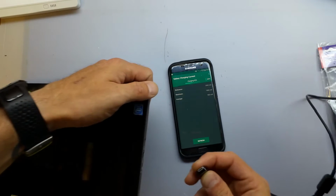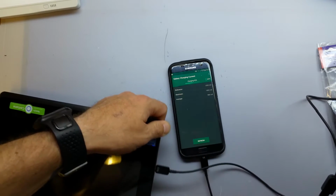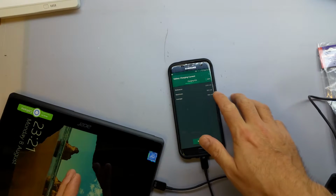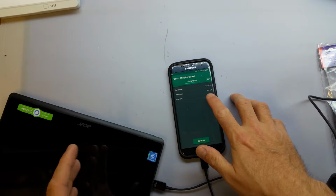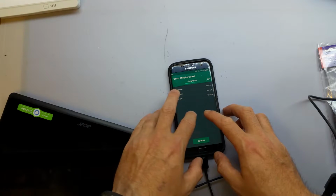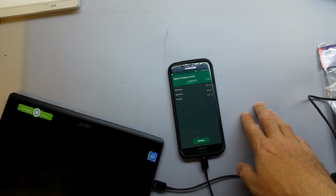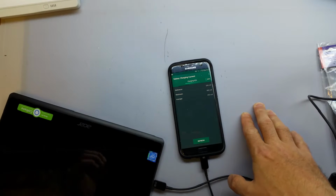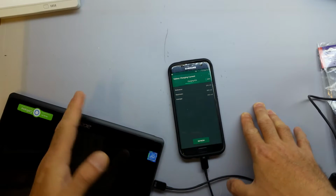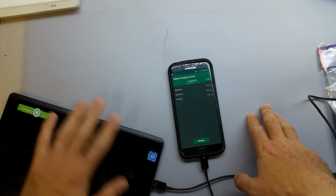When I plug in this tablet, if you remember, it dropped down to about 500 milliamps. But with the genuine charger, it's obviously sharing out the current, and it drops down to 800. Yeah, so I think that's a reasonable charging current that will charge fairly quickly on that. Obviously not as fast as 1800, but never mind. So I don't know if this is drawing maybe more power rather than it being split equally, 900 kind of thing. But yeah, it does obviously split it.